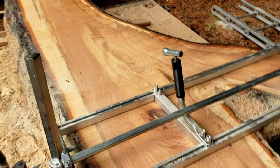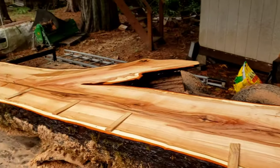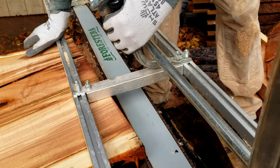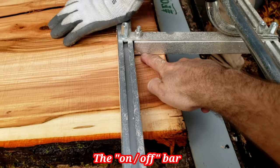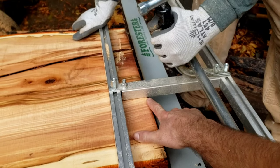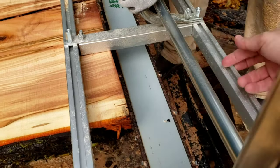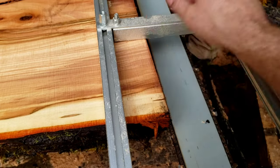As far as getting on and off goes, a lot of guys will use the ladder on top. But as long as you have this crossbar set up in the middle of the slab and you've got a guy on the other end willing to help tip the mill, it really isn't hard. Basically use this bar as your guide — it's easy to see whether it's tipped back or level. Keep that front part flat on there the whole way as you go, and when you get all the way to the end, the rear rail will just go right on because you've kept the front tight and haven't let it lift up.